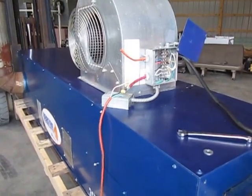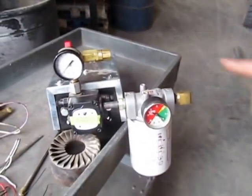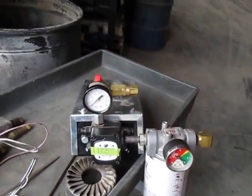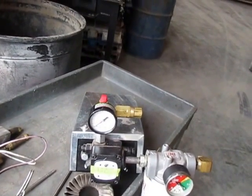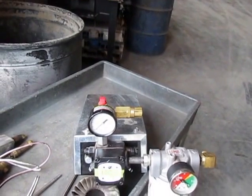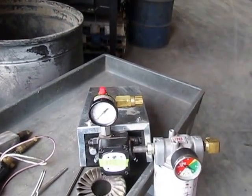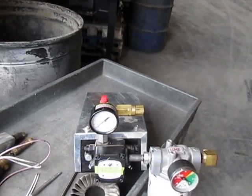Regarding the meter pump: be sure you have a leak-proof suction line, and be sure your pressure line goes uphill all the way from the pump to the furnace. Do not go up against the ceiling and back down because it won't bleed the air out properly. We have a good video on our website at centralohioheaters.com on the parts page with all the specifics on the meter pump.